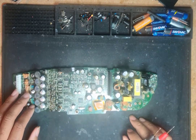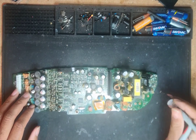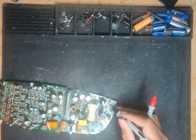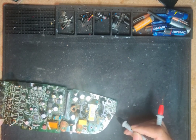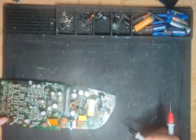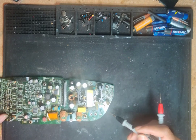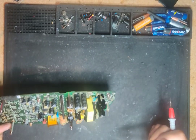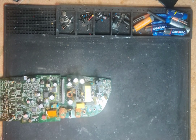Anyway, that's my rant. I just wanted to share the problems you might have: the startup resistors here if you have no voltage going to your switch mode power supply chip, and there's a resistor right next to the big tall component that controls the back-feed to keep the chip running. There are no schematics — I found nothing online — so I figured I'd make a video to help somebody out. It took me a long time and a lot of parts from this board to figure it out. Thanks for watching.